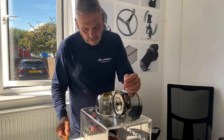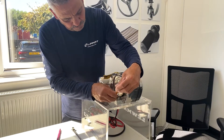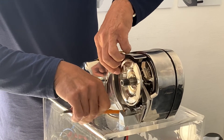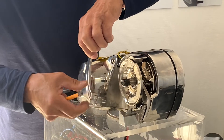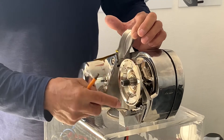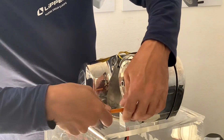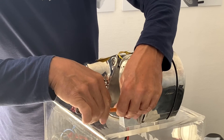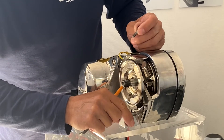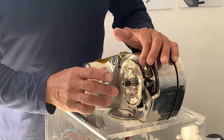At this point you'll need your 5mm Allen key. On this side here you'll see there's a guard that needs to come off — place that to one side. You'll notice you still can't get the gypsy out because the stripper ring is still in place. Remove this bolt here, which allows you to take away the ramp — place that to one side.